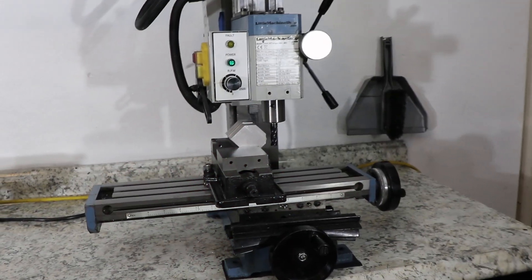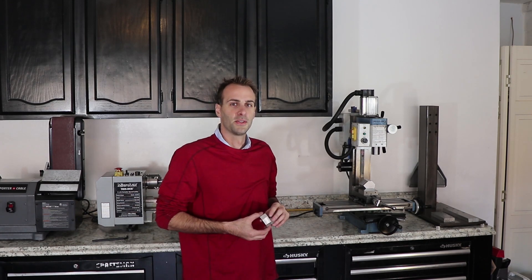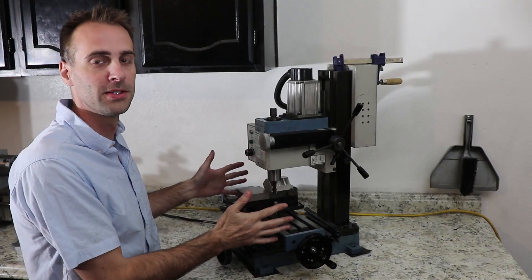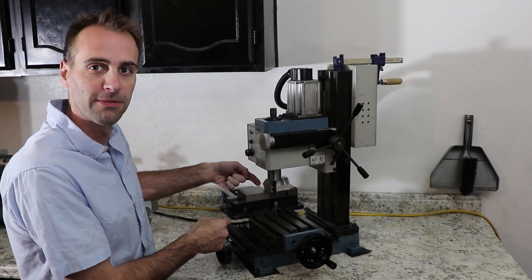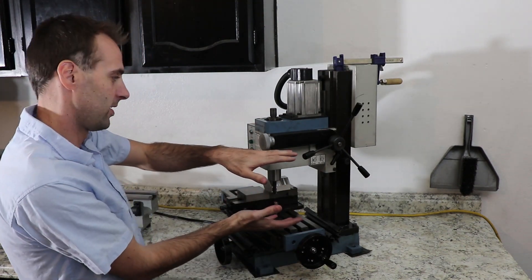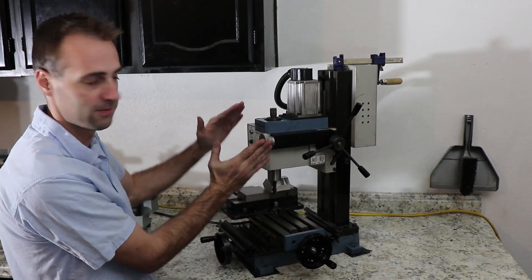We had a half inch end mill in the spindle doing side cutting on the corner of these square blanks to make a chamfer. The problem was this mill is not really stout enough to swing a half inch end mill when you're side cutting. The side load is out away from the part, and as the bit comes around it wants to torque the spindle. The dynamic modes are that this whole C-shape is going to kind of open up and resonate, and the whole head is going to twist relative to the table in and out of the part as you're cutting.